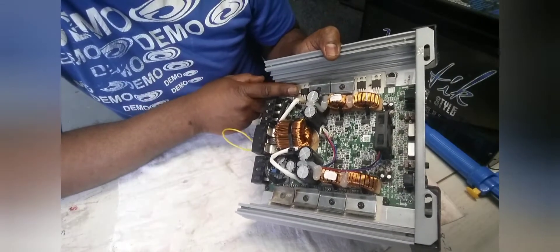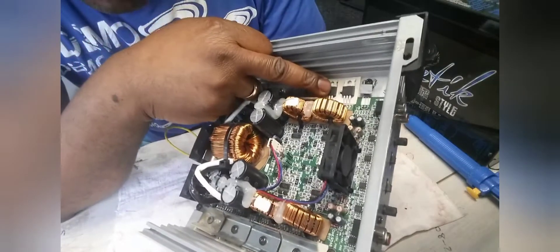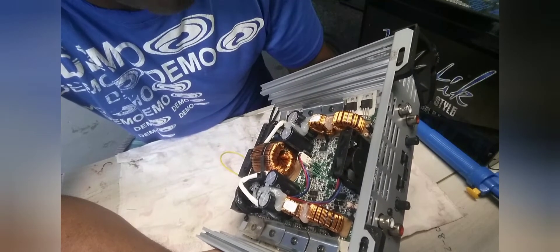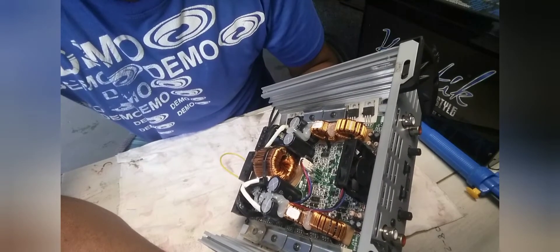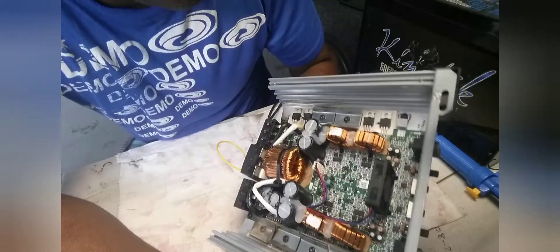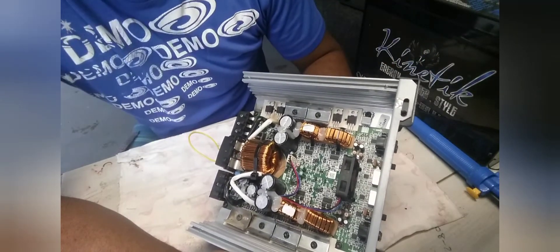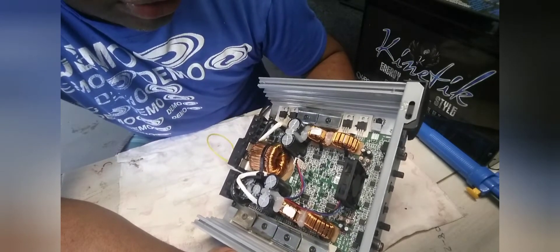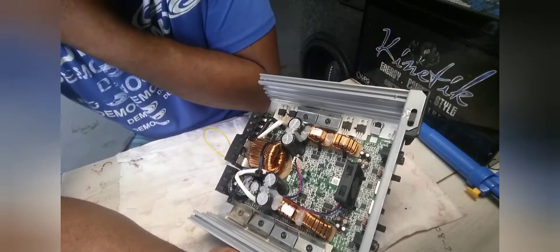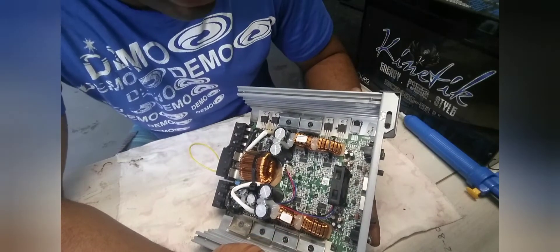I powered it up and everything looked fine. The output MOSFET also had an unusual part number — I thought it might be the IRFB4115 or IRFB4127, but it was actually the IRFB5620. I've seen those in other amplifiers. I replaced them with the regular IRFB4127, and I've also used the IRFB38N20 in amplifiers with the same circuit and they work fine.